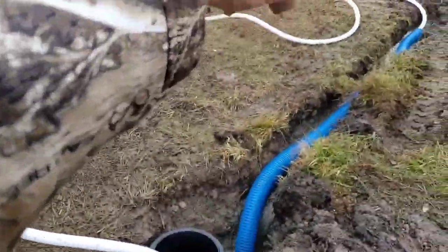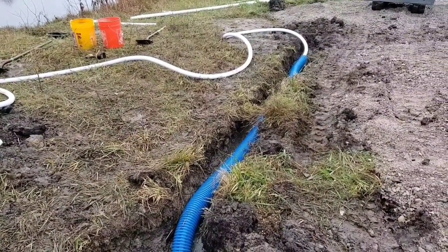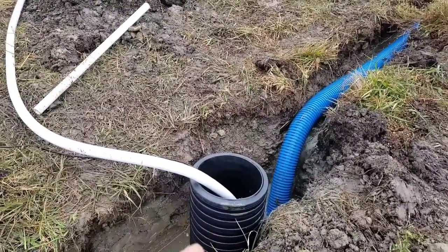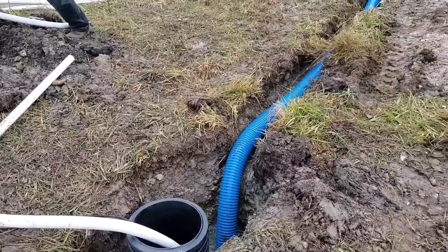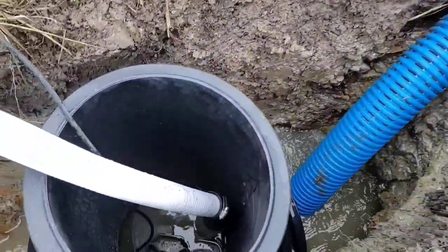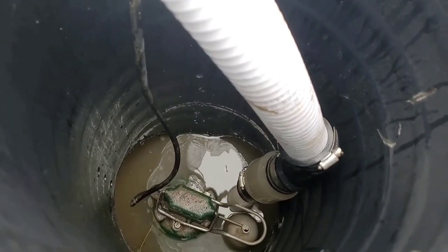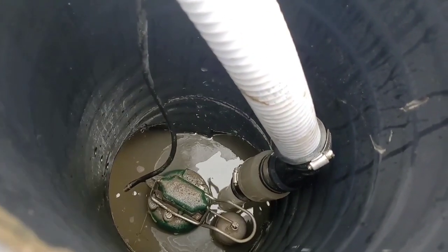All right, we're going to cut the water to the French drain, and we're going to stop the water from flooding into the French drain. And then we're going to let the pump keep running for the sump pump pit. All right, so you see the water slowing down right here. This sump pump is still pumping. Why? Because it's deeper. It's so much deeper than that trench. What would happen if this was shallow? The water would backfeed up into that trench like in the demonstration with the smaller housing.